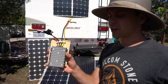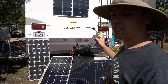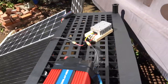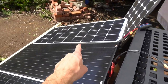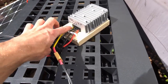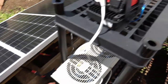The first test: we're going to connect this 48-to-12-volt step-down converter to 400 watts of solar panels and run an AC induction load with an inverter — just this, nothing else. We have solar panels, converter, inverter, and the appliances. The 400-watt panels are in series giving an open circuit of around 40 to 43 volts, feeding into this converter with a max input of 60 volts and an output of 12 volts, then into a 12-volt inverter to power the loads. Both fans have turned on!